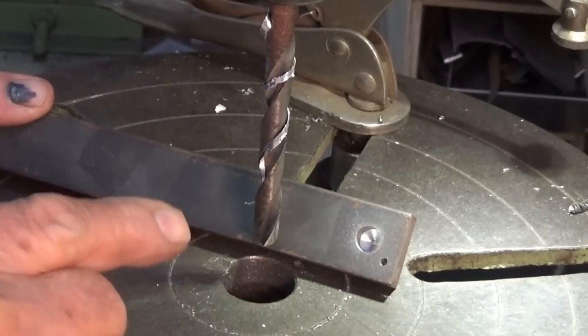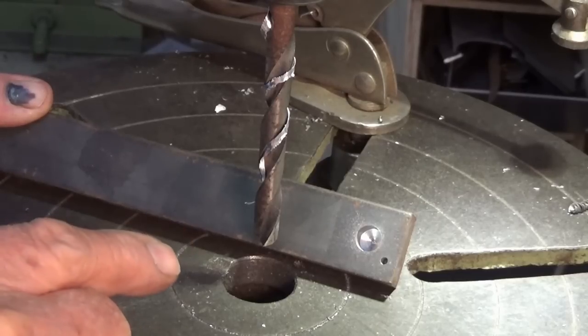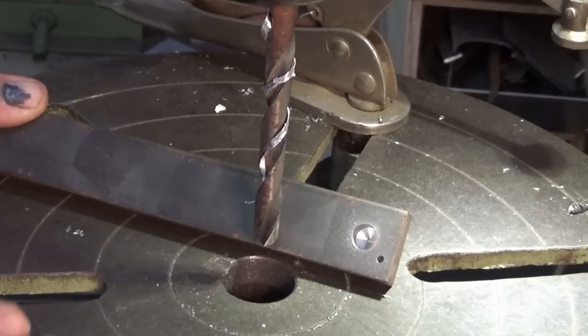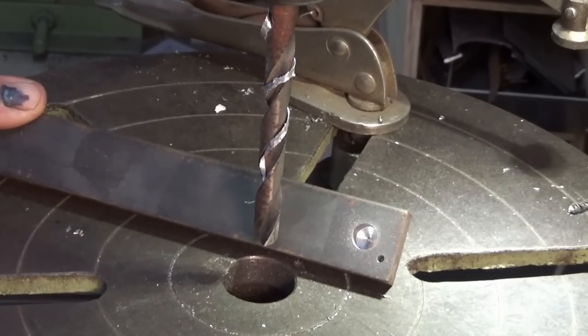The 3/32 is a little bit harder to push through than I would like, which might mean that there's not enough clearance on the end of that drill bit. But certainly in steel, with this one here, it's quite good. All right, now I need to go back over the bench. We'll talk about the mistakes that were made and how I rectified that and what's happening in the next video.